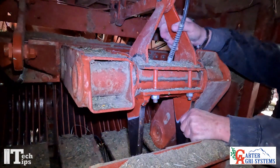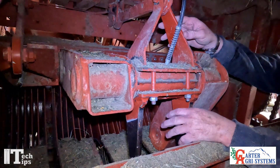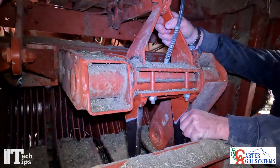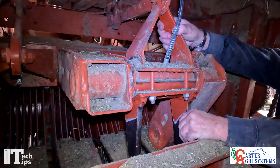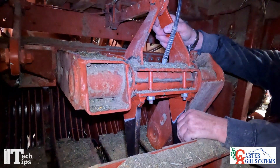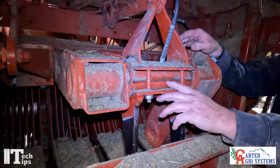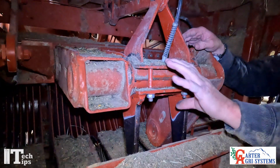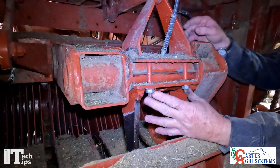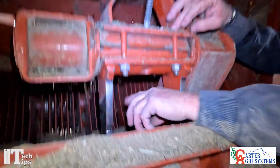This applies to your 4900, 4910, 4790, and 4755 balers — all have this older style — and even your New Holland balers are like this. If you have any type of play, you're going to have to take shims out. There are shims that go right down inside here, so you'll come in with a clamp, hold this, and take your impact gun to undo these bolts and loosen up the two back bolts.